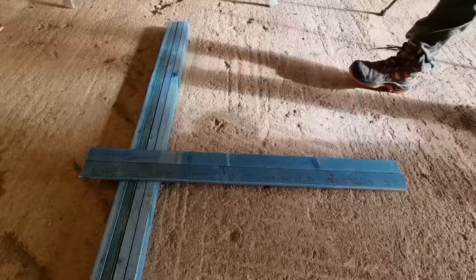I've got plenty of meat in the brick to take that screw. I said I'd put my ear defenders on and forgot — I apologise, I shall put them on, they're right here. Before I screw that in, I'm going to get some packers. Because if you screw it in and then unscrew it, sometimes the thread will make the brick crack and it will become loose. You want to screw it in first time and leave it. You can buy these packers in big bags from anywhere — I'll leave a link in the description because some people say they couldn't find them.